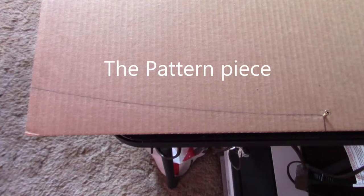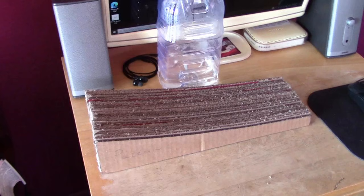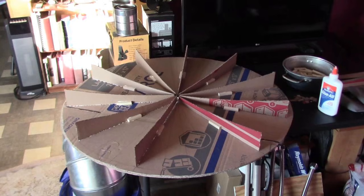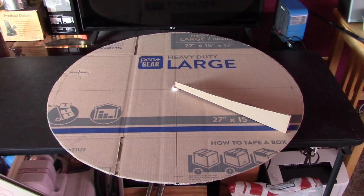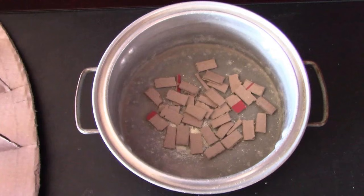To cut the fins you make a pattern piece using the pin and string method. It's three quarter inch on the front end, about two and five eighths on the back end, and it's a 15 inch long fin — so together it makes the 30 inch dish, two and a half feet. Remember to cut off about a half inch off the front of each fin so it fits right inside the 30 inch circle, to compensate for the pipe in the middle.